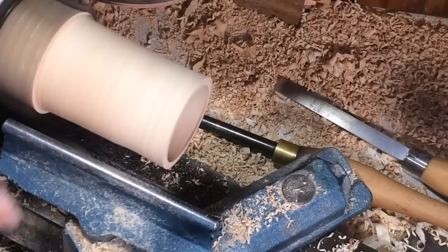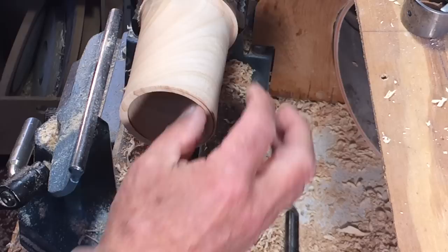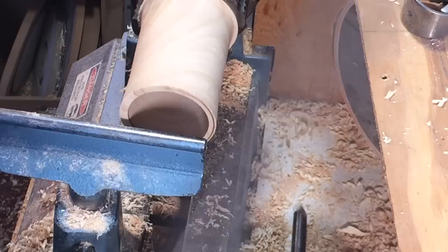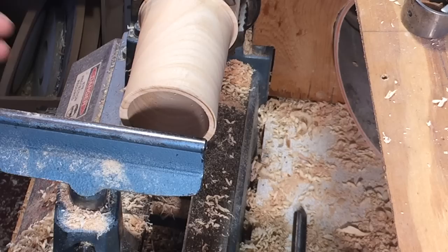And then we're back in the real world with commentary and lathe sounds as well. The lathe sounds are always so important to hear. So there's not very much at all to play with in there. So this piece might be a write-off, or it might end up as a much shorter pot than I'm expecting. Just ought to measure the depth first. So I'm down 110 millimeters to there. So that means I have 20 mil, 3/4 of an inch basically in the bottom to play with. So that's fairly comfortable. So if I don't get the whole deep thing, I will at least have that.